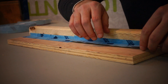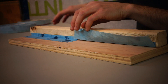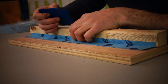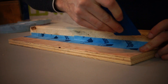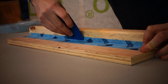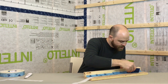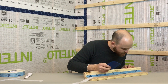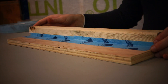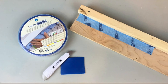You apply along the straight edge. Just as with the other one, you apply using the PressFix tool — it gets you those nice, perfect corners. All Proclima pressure sensitive adhesives need to be pressurized, preferably with the PressFix tool, in order to adhere fully. And you're done — airtight, watertight seal.